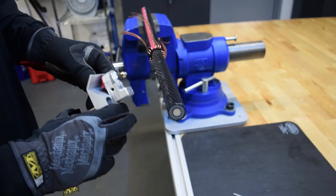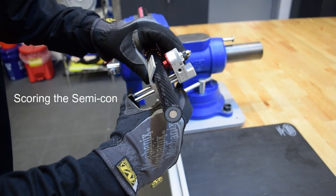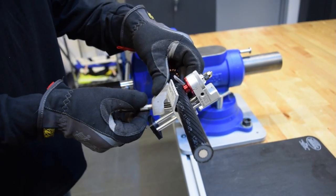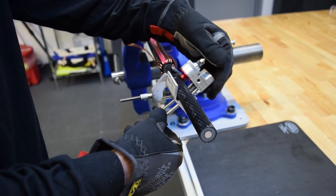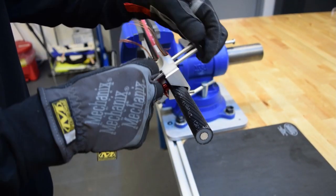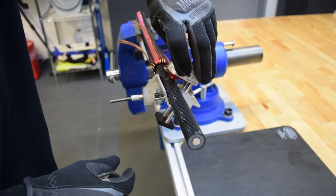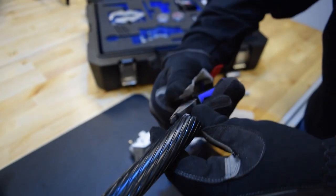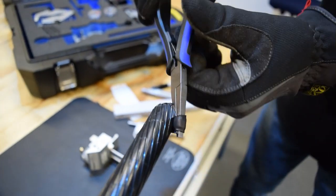Next, with the neutral wires pulled back, we're going to grab the SCSC clamp and the SCS. Using a ruler to mark on the semi-con the exact distance to place the clamp, you will now put the SCS up against it to ensure a proper ring cut. After setting the correct blade depth, we're going to do the ring cut with the SCS and then spiral down the semi-con. Then we're going to use the pliers to lift the corner of the semi-con and carefully unwrap it.